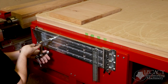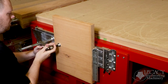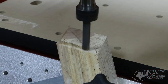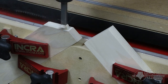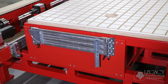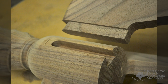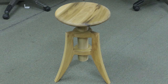The vertical table workstation machines along the ends or edges of the part. The milling capabilities are the same as the horizontal table but focus more on joinery. In addition to mortise and tenon, dovetail and finger joints, these capabilities include surfacing, pocketing, and profile cuts. Each milling process can also be applied to flat and mitered surfaces. The Renegade's vertical table can produce mortises, tenons, full and half-blind dovetails, sliding dovetails, finger joints, bridge and castle joints, wooden bolt threads, and more.